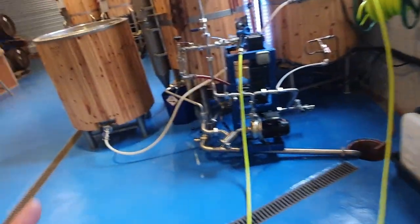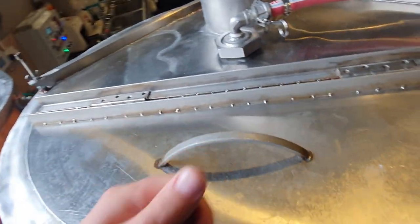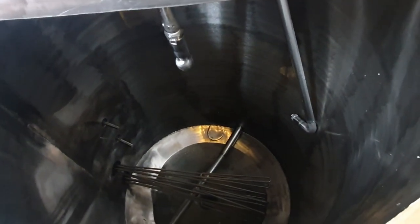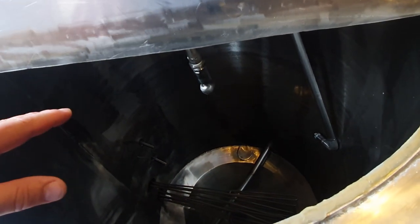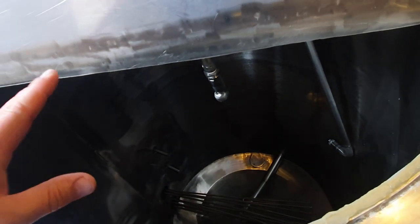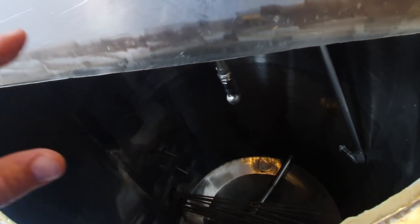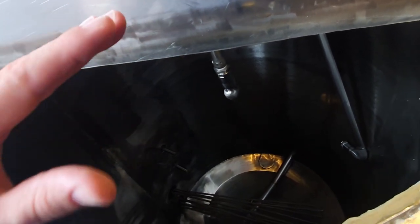We're going to wait until there's some actual liquid showing in the mash tun before we add our acids. In the meantime, the boil kettle — because it's been standing — was clean when I left it, but we filled it up yesterday with some caustic and recirculated that through the whole tank and through the plate chiller. So what I need to do now is rinse out this caustic. It was fine being left in here overnight. Don't do that if you're using a caustic that's got hypochlorites in there, because it will damage your seals. This is just sodium hydroxide, so we're fine.